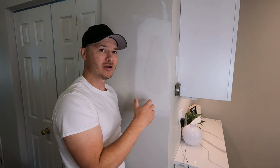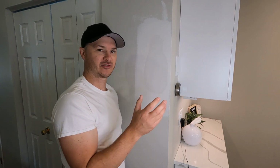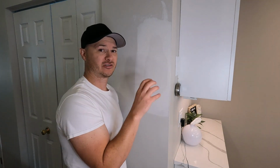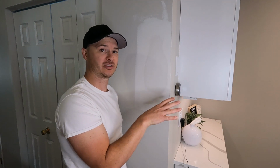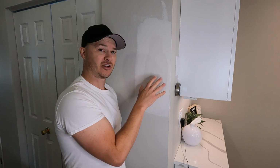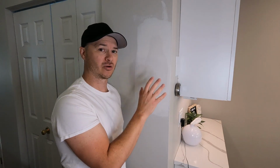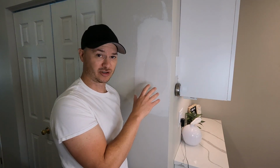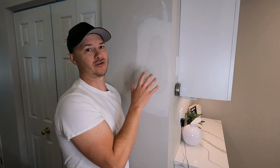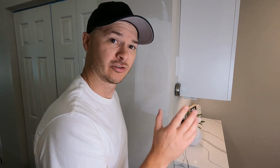Now when you're doing new drywall and you've got a whole house to do, compound's great. The pre-mixed stuff that you buy in the boxes or the big buckets is great because you have lots of time for it to dry. It's going to dry faster because it's going to soak into the drywall as it dries. In this case, when you're dealing with patches and you're only doing one, you want to get this done fast. The 20s or the hot set muds, the fast setting compounds, the mixing type compounds, that's the way to go. Get used to using them, and they're going to be a great asset. They're a great product for doing all sorts of patches. You're going to get a better finish, and you don't have to wait 3 days for stuff to dry. So we're going to sand this.